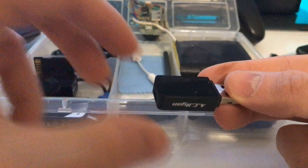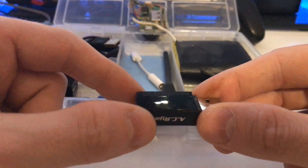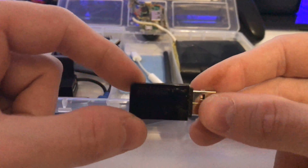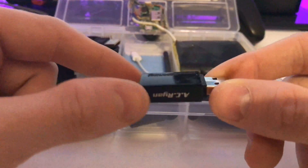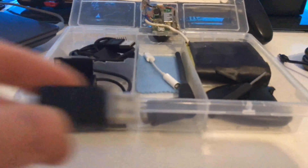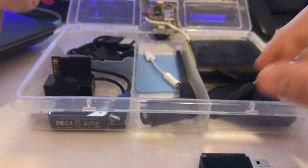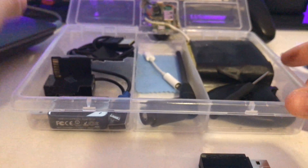The reason I use this USB Wi-Fi dongle is I will create a hotspot from it on my laptop that will stream internet to my 3DS. What that does is decrease the range between your 3DS and the router — making it from the 3DS to this USB stick. Since I have a USB hub, the range will be from here to my table, which is much stronger than going all the way to my router. This makes it possible to get a much stronger connection while streaming your display. This is optional but very useful.